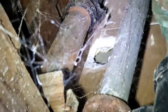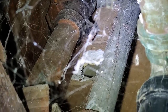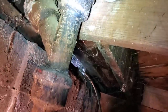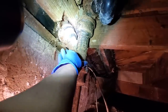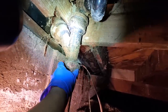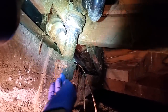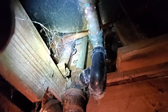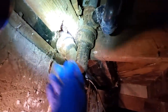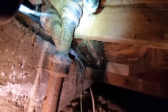Not a lot of options here. The only options besides clamping onto the outside of the fitting or getting the broken piece out from the inside is to come over here and basically cut here, cut it here, and cut it here, and put a rubber tee in. Then go down and drill a hole in the floor, go up to the sink — but that would not be to code because the vent or vacuum break needs to be above the tee. Also, I'd have to cap that opening because you can't leave it open puking sewer gas into the house.